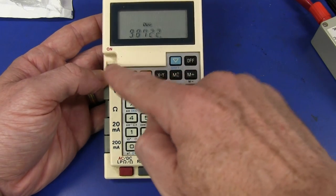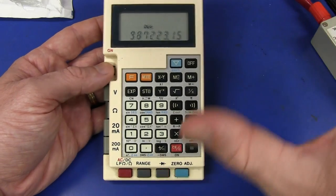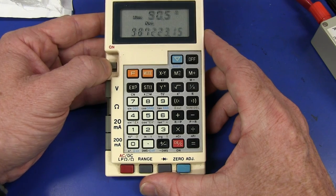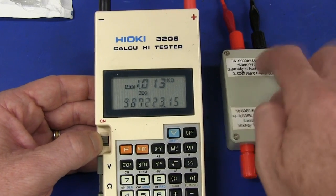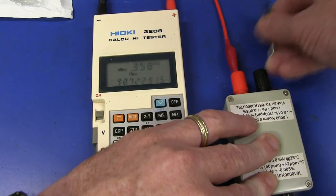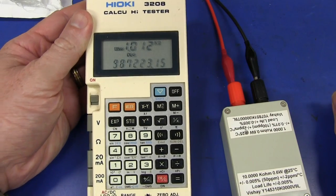That's why they don't bother putting it after the on switch - because you might as well just leave it permanently on. It draws like a microamp or something like that. So I'd expect the calculator and the multimeter to not be tied together in any way - entirely different circuitry. Turning it on, the multimeter seems to be working. I've got it hooked up to my 1K precision resistor here, and it's a little bit out. But it did take some time to get up to that value. It's not the world's quickest thing, that's for sure - it takes forever. Slow as a wet week.